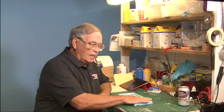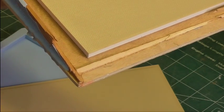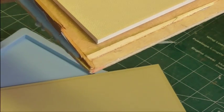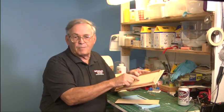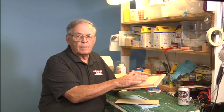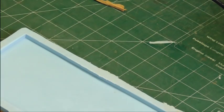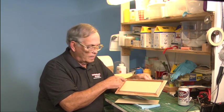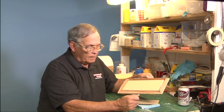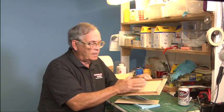Now when I lay it down and put another piece of plastic on top, I'll get a piece that looks just like the original. This thing is extremely thin — I made this one much thicker, almost a quarter of an inch, because since I'm building in plaster, I need it much thicker so it will hold up. There is a piece of gator board inside to keep it from sinking so any pressure won't cause it to warp. If I tried to demold a thin piece, it would break coming out of the mold. I took crazy glue and put it all around the inside edge of the walls — my dams around the mold box — and super glue around the bottom edge to keep the silicone from running under the piece or out.